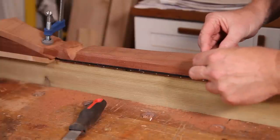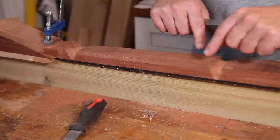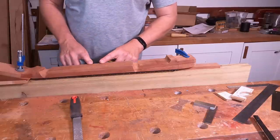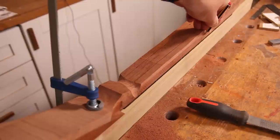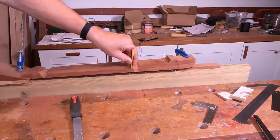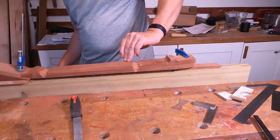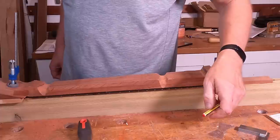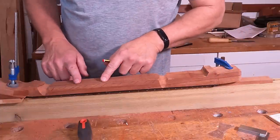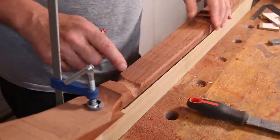What I'm going to do is take some measurements - I'll just use my centering rule to find the halfway mark on each of the two halves of the neck, and then I'll use a rule just to join those two lines up. Then I'm going to eyeball this and put a line approximately halfway down both sides of the neck. Then what I'm going to do is remove all of that material on both sides of the neck at kind of a 45-degree angle - we'll form the first of those facets that I'm talking about.